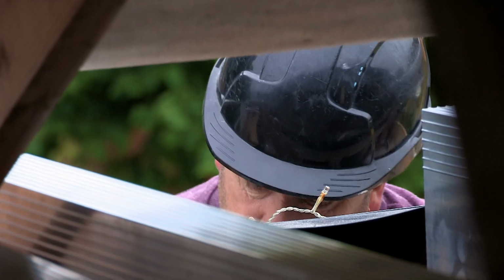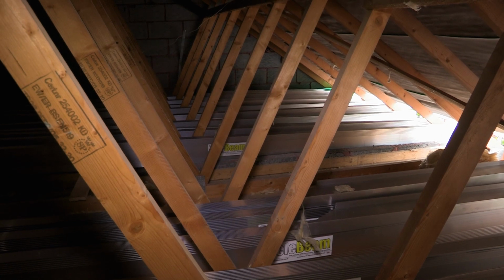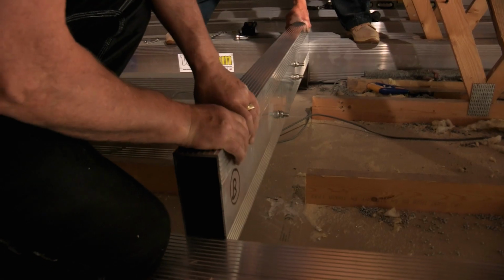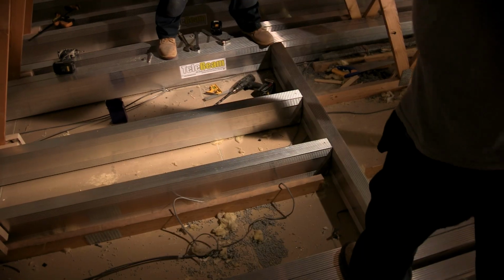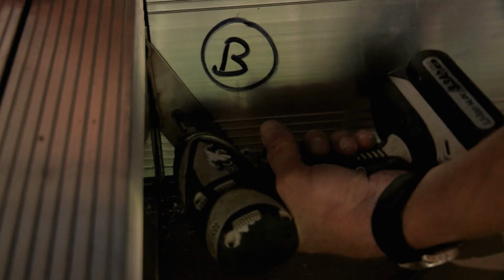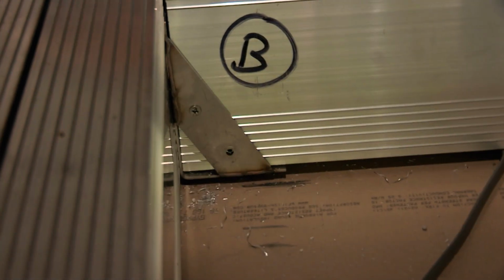Telebeams are positioned against either side of each truss throughout the length of the roof or as indicated on the beam layout provided. Multiple trimming telebeams are provided either side of the stairwell. The stairwell is formed with trimmers supported on hangers bolted to the telebeams.